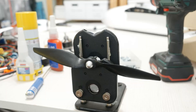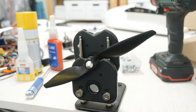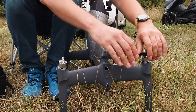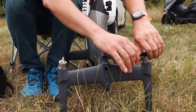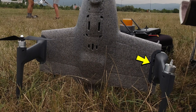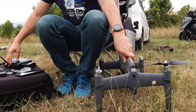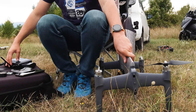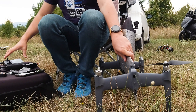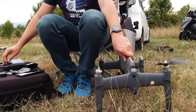Most notably, I balanced some props and that turned out to be an adventure all on its own. The first method I used, which is the most basic one but does yield some little improvement, was to balance the props via the motors. I had one motor module disconnected but still on the spar so the plane would sit upright, and the other had a prop only on one side so I could feel the vibrations from only one prop at a time. Had to be outside because the plane will not arm without a GPS lock, hence the location.